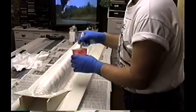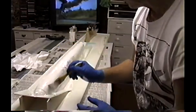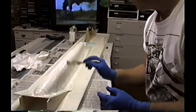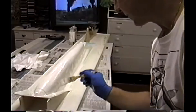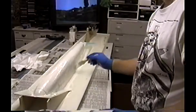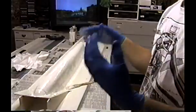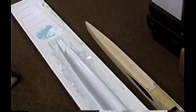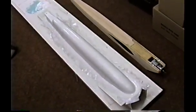Now I want to go in with more resin. I think you can figure the rest of this out. This is the fun part. This part usually goes pretty quick. Just need to make sure all the corners and edges are filled. The last thing, I'll put 6 layers of 6 ounce on here. You can pretty well figure this is going to run ahead. No sense just watching it redundantly, but once that's all covered and laid up, that'll go to dry overnight. Basically ends a real nice layup. Went well. And we've made some progress on the wood fuselage and on the composite one. So I'd count this as a relatively good day.